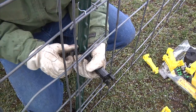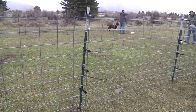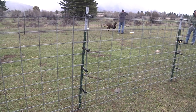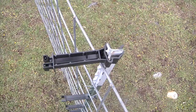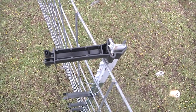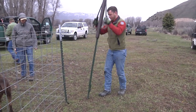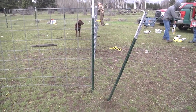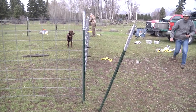Now place the insulators. 4 insulators per T-post placed at approximately 10 inches, 20 inches, 30 inches, and 40 inches. Each wire is going to be hot. The panels will be grounded. At each corner, pound another T-post at a 40-degree angle. This will be used to run the wire around the corner and not allow for any grounding to occur.